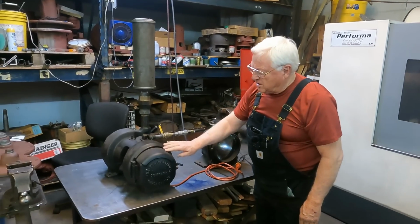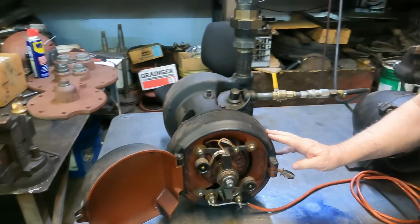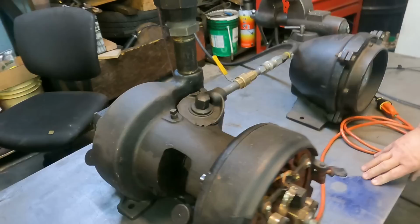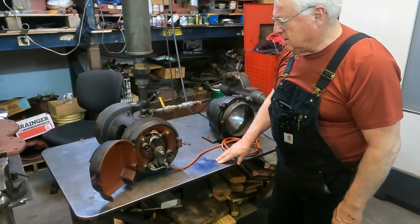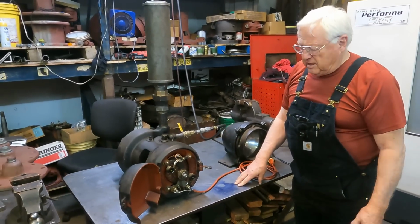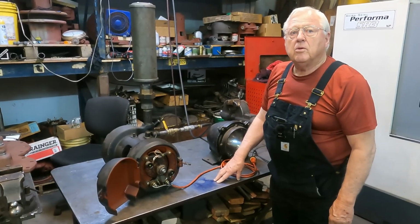This is a Pyle National K240 dynamo, a steam-driven electrical generator. It's actually one designed for New Zealand and Australia with a removable portion for the governor valve. And this is the most common of the Pyle National turbines. 32 volt, 400 watt maximum, pretty much just to power the headlight, the tail light, and the cab lights in the steam engine.